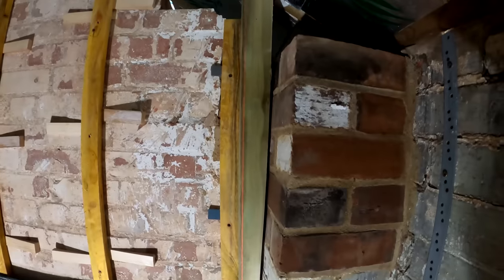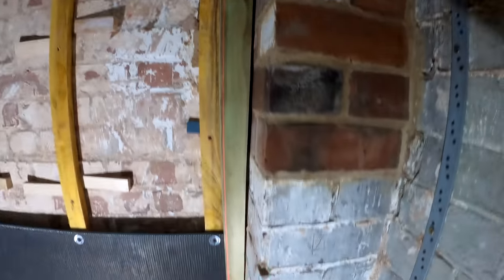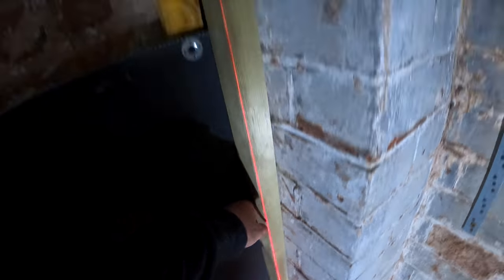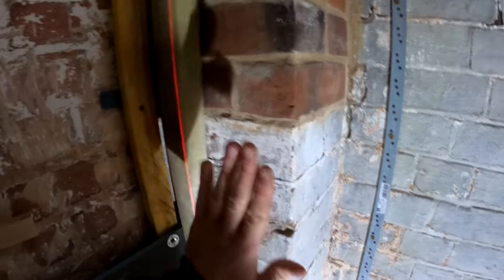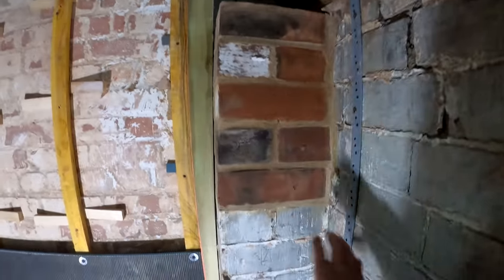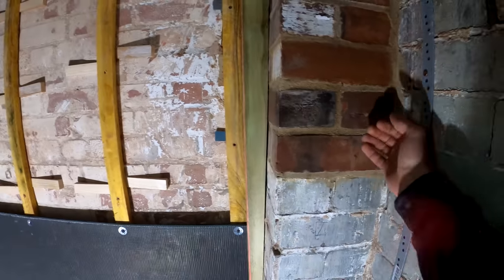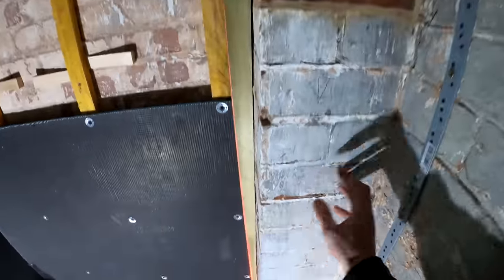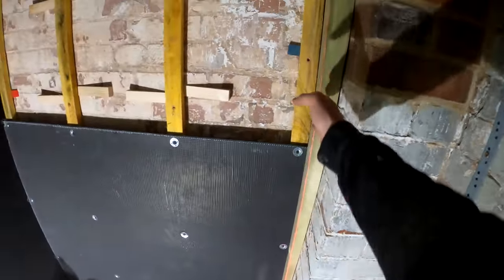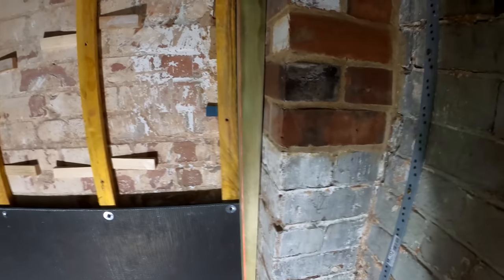So you can see the bit that I've cut now and how that's going to work - it's going to sit in there. You can see how badly this pair is out, so that will obviously be fixed back to the wall like that and work nicely, it just needs to pack out a little bit at the top. Once that's in, I'm going to build a ladder frame here - so basically two bits of timber coming across, fixed into the wall there, sitting out here. Then I can fix through my legs that come across as well to hold everything nice and solid, and then the board can just carry straight across from this point to that point.